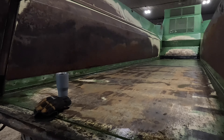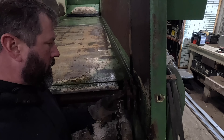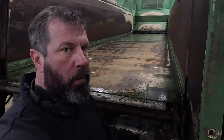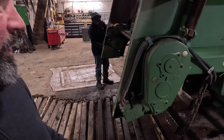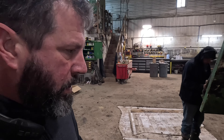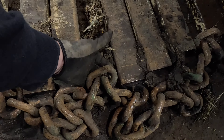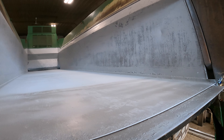Now we're just going to paint it — try and cover up some of this rust before we put in the new floor. We have these sprockets here that are getting pretty worn. So we're going to remove all this — take these gearboxes off, pull that shaft out, and replace the sprockets. The chain that runs the floor and moves all the product to the back — that's a pretty good-sized log chain, very heavy duty. And that's painted beautifully now.